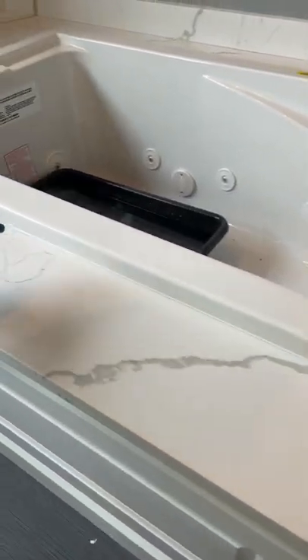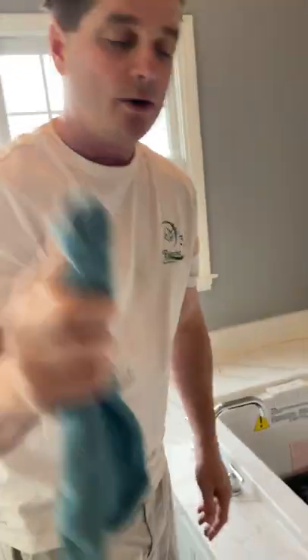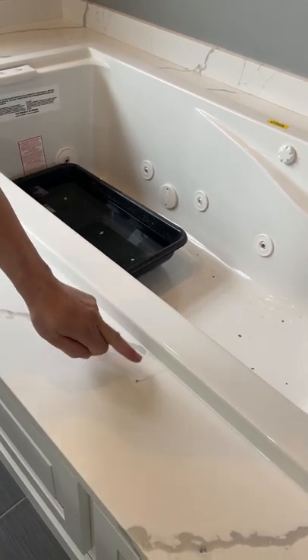I'll spray down the surface here. This ensures that when I wipe with my finger, the caulk is unable to stick above or below the caulking area — that's what comes off. I'll use my rag and slowly go down the surface, then go back with my finger. By applying the right amount of pressure we didn't create a huge mess — we effectively got all the caulk in the gap without getting it on the side of the tub or onto the quartz.